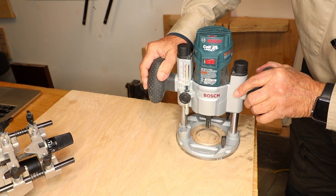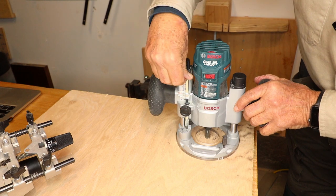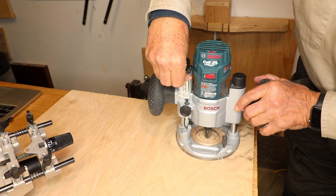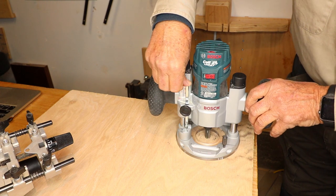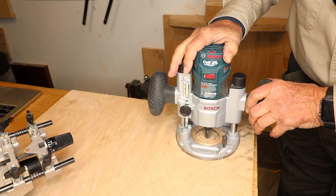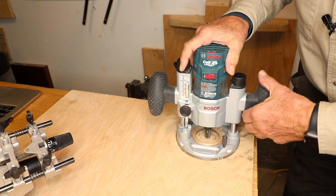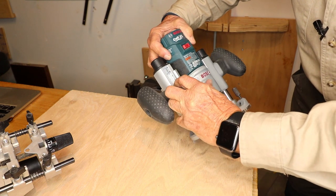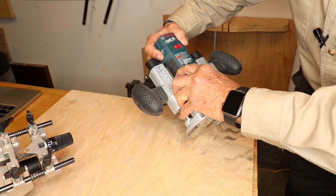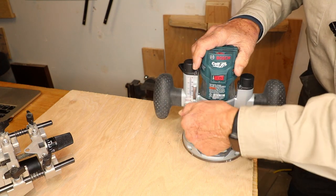Plunge your router down to the top of the workpiece. Push the rod down — you might have to loosen the thumb screw — push it down to where it's touching that bottom plateau. Tighten it for a moment so you can move the plastic guide without moving the rod, and line the plastic guide up with zero. Then loosen.